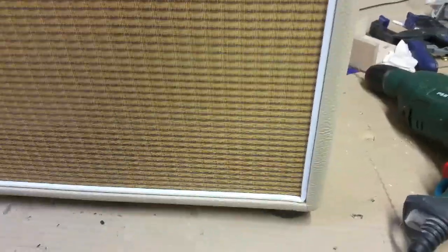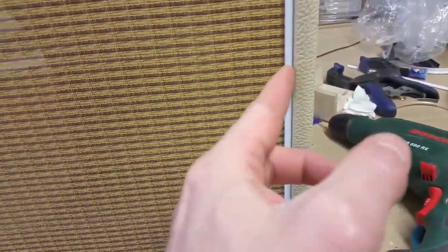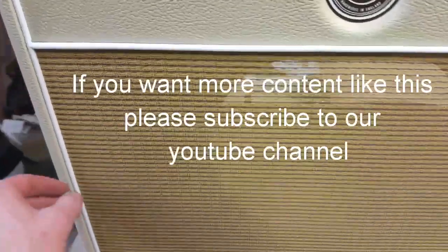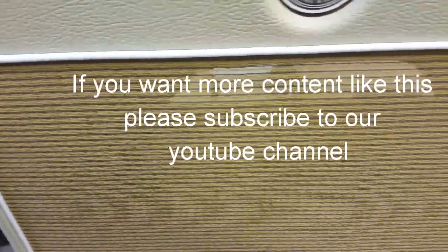The other trick to getting the piping really straight when you do your cabinets is you need to make sure there's actually a fair amount of pressure on the piping from the actual wall of the cabinet. To do that you need to get your clearance pretty bang on — I go for about 3.2mm clearance all the way around with this sort of grill cloth. If it's a thicker grill cloth like the basket weave, then you need more clearance. The tighter it is, the more it gets pushed — the straighter and smoother it stays.